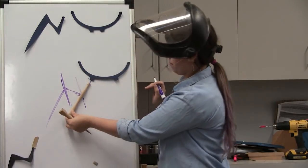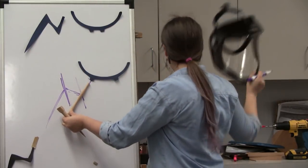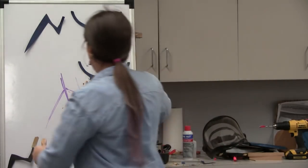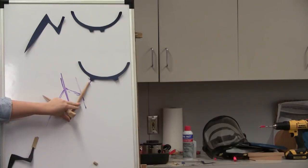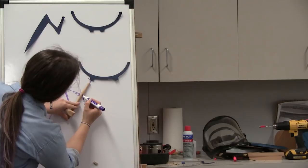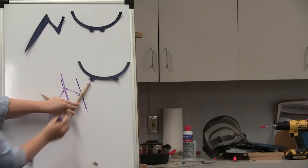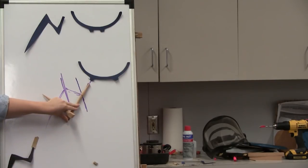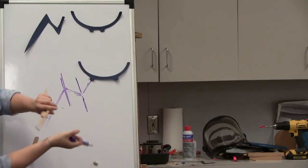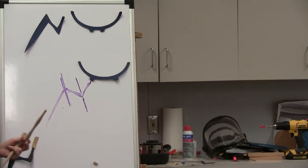What I would want to end up doing is, can we see with my head in the way? I don't need that anymore, actually. Is holding this in place. Okay, am I going to be stepping right in the way right here? Okay. Holding this in place and looking over it, you are going to draw a line directly across, copying this line that we drew in behind it that bisects that angle. Okay? What that'll do is if you cut this, flip it 180, it'll double that angle, and then it'll make it follow this path. Do you guys want to see?